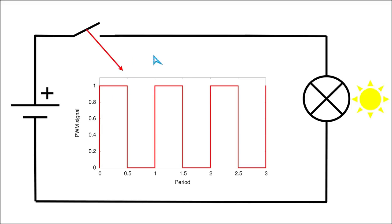In contrast to linear power supplies, pulsing is a technique of all or nothing. For a fraction of time the full power flows through the circuit when we close the switch. After we open the switch for a short time, there is absolutely no power going through the circuit. The main idea is that we can adjust the average power flowing through the filament of the lamp by turning the switch on and off in quick succession. We can use the pulsing technique since there is a small delay in the rise and fall of the temperature of the filament.